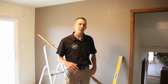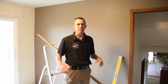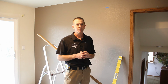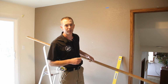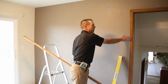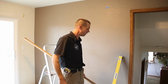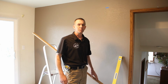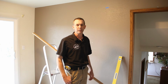Everything we're going to be giving you today for measurements and everything is in there. We're going to be making this installation specific to this door size, which is 2 1/4 thick. What that means is it's going to require a little bit of a spacer right here that's going to go behind the track so that the door has enough clearance to clear the trim around the opening and slide freely. Right now we're going to put this spacer up so that the bottom of the spacer is right at the top of the door and not behind the door, it's only behind the track.